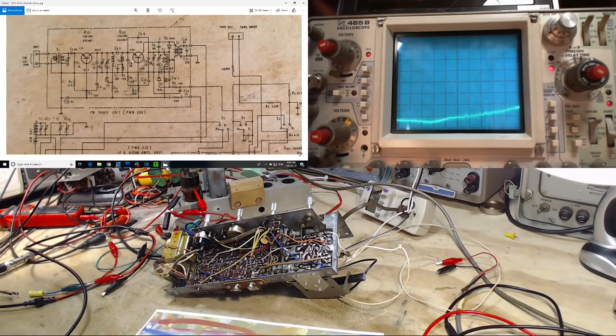And I've checked this capacitor, good. I've checked the resistance here. There's a resistance. I've checked this capacitor. It's not shorted. I have not checked this one here. But I poked all over the place in this circuitry. I checked all this stuff. I spent a lot of time checking all these things. Couldn't find a single reason for anything to be out of sorts. I checked these diodes, the whole shot, everything. So why don't we start with this? This is 0, it should not be.